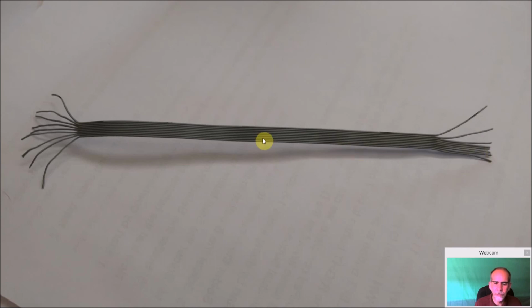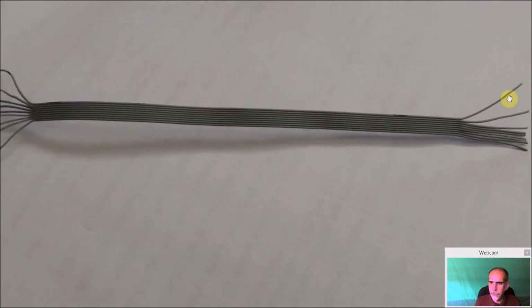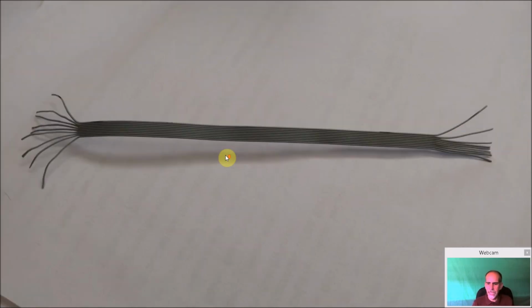So you can see here's the wire. It's just an IDE cable. This is about 8 inches. I would probably recommend using just 6 inches. And what I do on all of them, you can see it here a little bit, I take a black marker to mark pin 1. So I have black marker all on this side, just so I know when I'm working from the diagram, this is my first wire, now it's my second next to that, third next to that, fourth, so I can follow it down the line. Because when you use an IDE cable, they're not generally marked in any way, shape, or form. Now, you can buy wires that are already color-coded, but again, that's an expense. This way, you have an old cable lying around, use that.